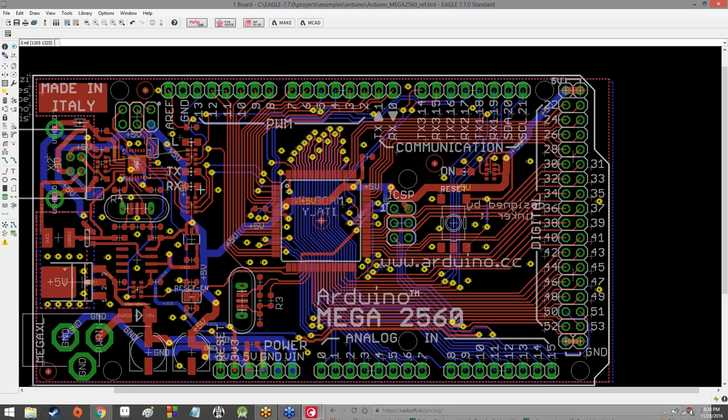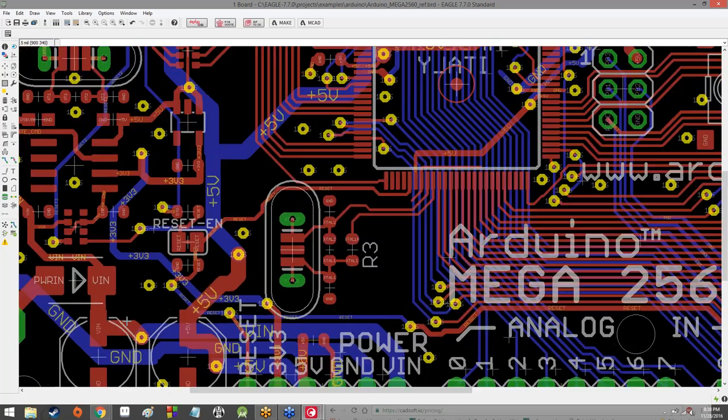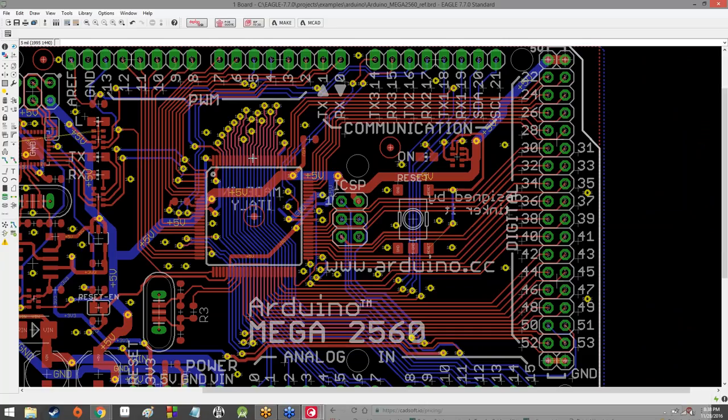But yeah, this is another thing that you would do as a circuit designer: you would design how the individual tracks and stuff like that are all laid down. A track is one of these lines that denotes how one thing is connected to another and where it's specifically laid out on the board. So similar to the schematic, this is denoting what's connected to what. But it's different from a schematic because it is telling us exactly how it's all going to be laid out on the board.